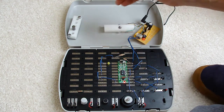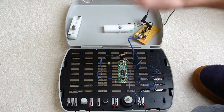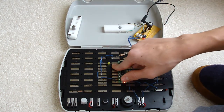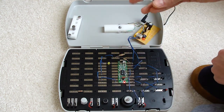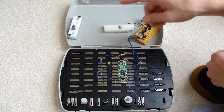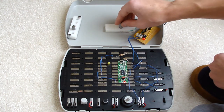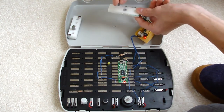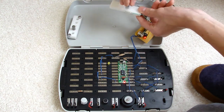What concerns me though is that there's a delay from the time that the beep goes off and the LED goes off. So I probably won't be able to drive the SCRs — or whatever I do to switch the coil — from the PWM output. I might somehow have to use the beep, or change some of the software.